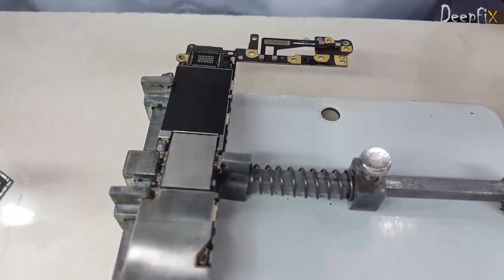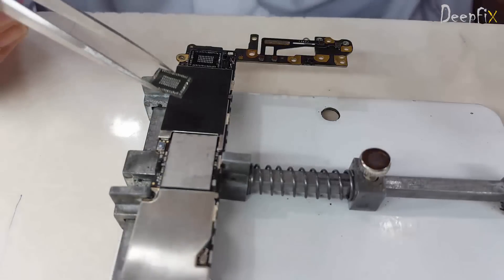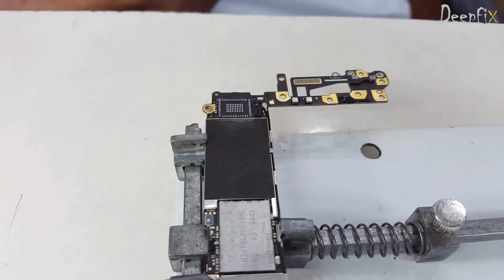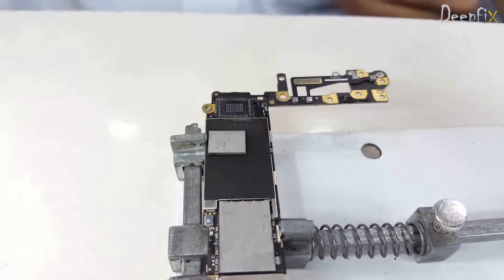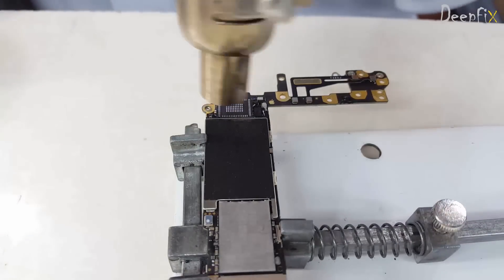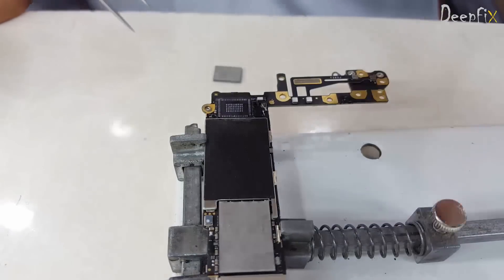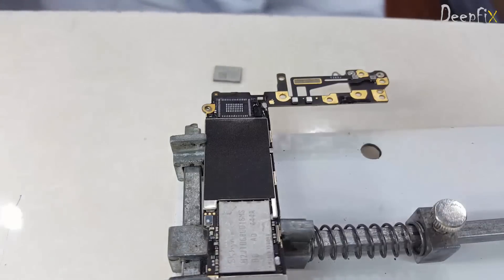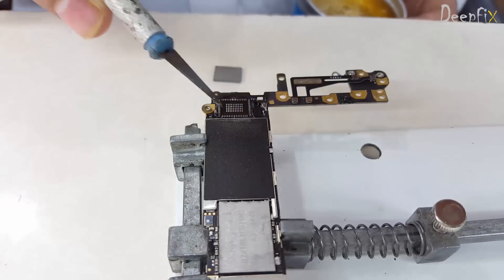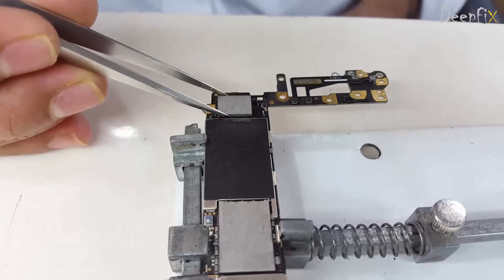You can see this old one. Clean the board — remove extra lead and the glue. This is the new one. Just apply some heat to the PCB so that you can apply flux in a proper way.